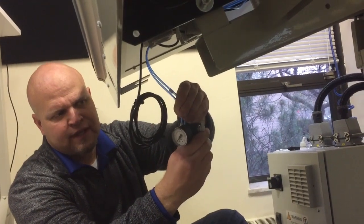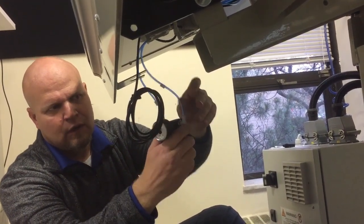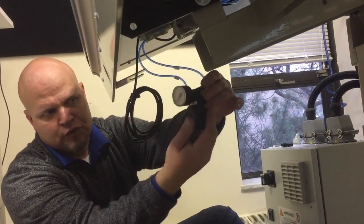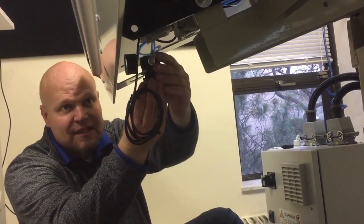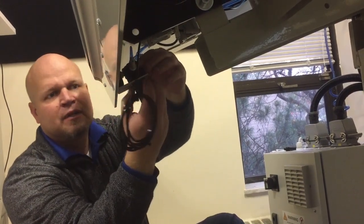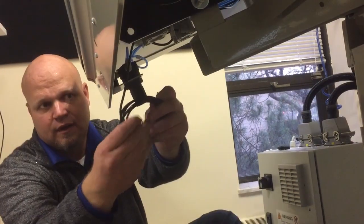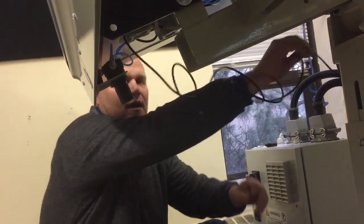Connect the air regulator gauge using the 2 push valve connections. The appropriate lines are labeled 1 and 2 to match the labels on the 2 connectors. Slide the regulator in place so the gauge shows through the front of the machine, and tighten the nut to hold it in place. The remaining air line connects to the air regulator mounted on the stand.